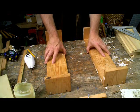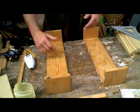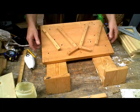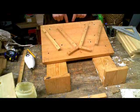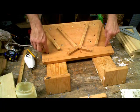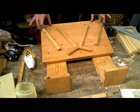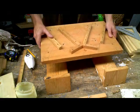This is the jig I use for horizontal top bar hives. The sides of the hive simply sit against these end stops, which gives me the exact dimension for the interior of the hive. Here's another example — this jig is for the ends of the horizontal top bar hive. I can place this on top of an end section and use these drill holes to drill straight through, giving me screw holes for fixing the ends to the sides, and also bolt holes here and here for fixing the legs. The legs drop into these guides so I can drill the holes through for the legs from the other side. That saves an awful lot of time when building a horizontal hive.